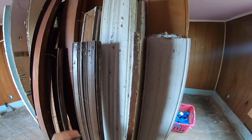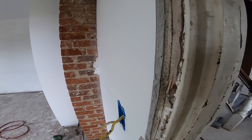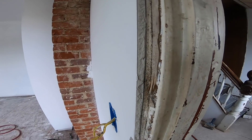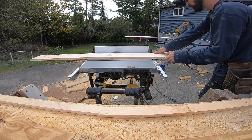During the demolition stage we saved all of the old trim — I really like it. You can't buy stuff like that anymore without spending ridiculous amounts of money, and I really like the fact that it's original to the house. So we're going to try to reuse it. Right now I'm going to be putting the little strips around the door frames to bring the trim out level with the new sheetrock on the walls. I start out by ripping it down on the table saw and attaching it with my brad nailer.